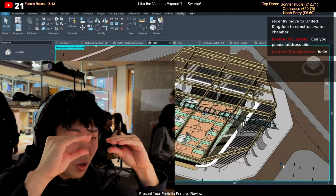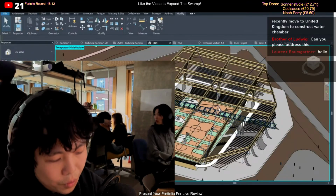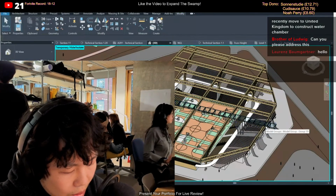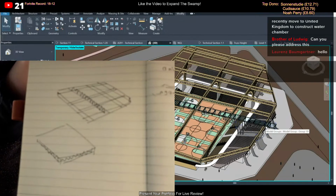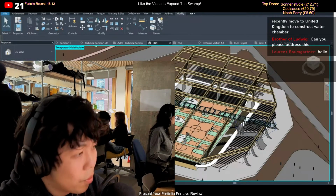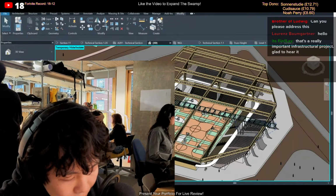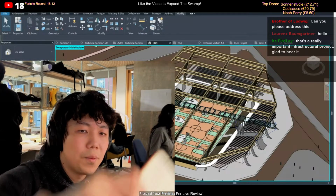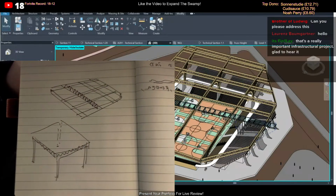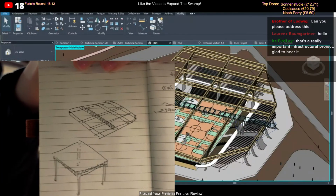But then, to hold these pieces, let's imagine that as a finished thing, like a piece of cardboard, literally those cardboards that have triangular things in between them. That works. So now the problem is to support this cardboard. If I was to simplify, it's like a table. You have these columns that support it. Yours is more on the inside of the entire roof, not on the very edge, but the same idea. You're supporting it through a grid of columns, right?